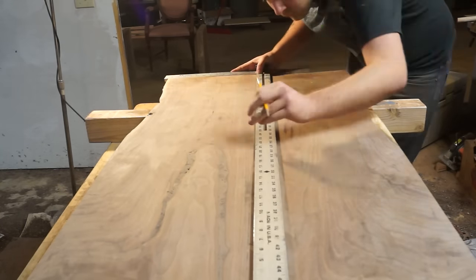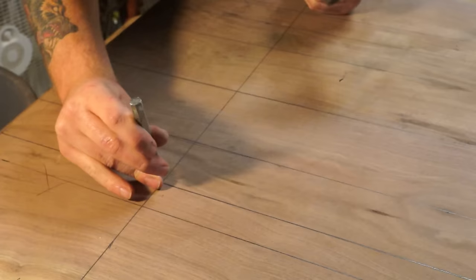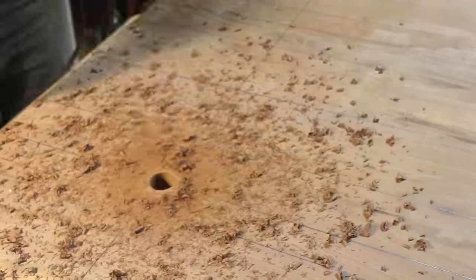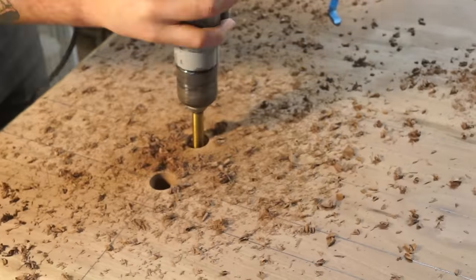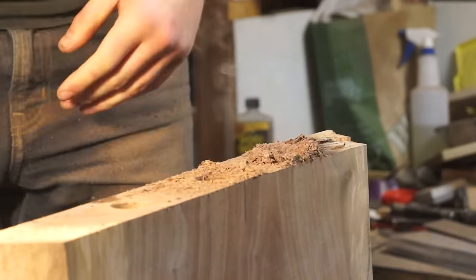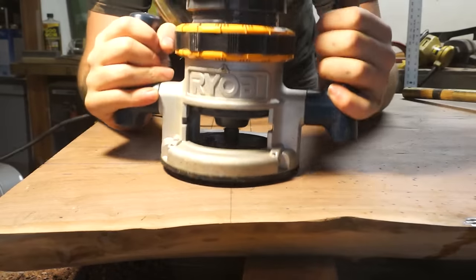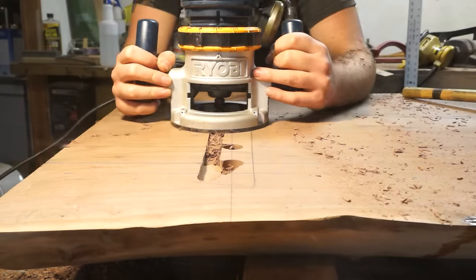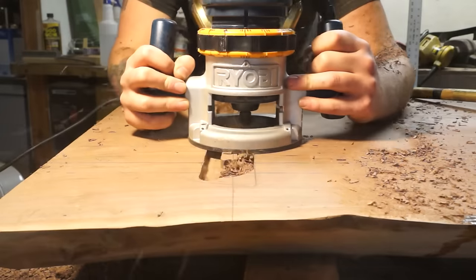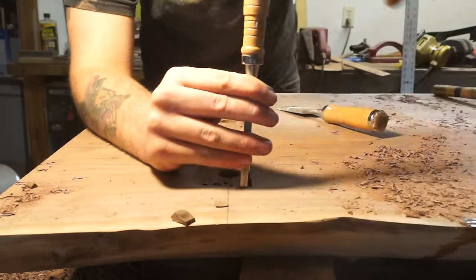I moved back to my tabletop and plotted the points where I'd be putting dowels for my legs. I punched each cross point before I drilled it so my bit wouldn't wander on me. I'm using a 1 inch Forstner bit with a 1 inch dowel on each point. After I had my holes drilled and my dowels fitting, I outlined my slab and used a router to cut a recess into the table bottom. This makes it stronger but really it just makes it look a lot nicer — much higher end than just butting it up with dowels.